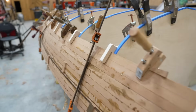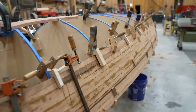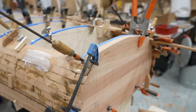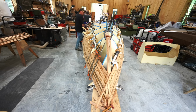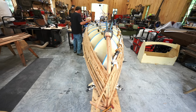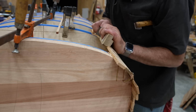and these little CNC clips just start to help me apply downward pressure. And those screw clamps, I do this technique, and again, I showed more of these details on Instagram, but I screw clamp the tip. The tip of the screw clamp is grabbing the planks that are already glued, and I make them really tight, and then I shift them sideways. And by shifting them sideways, it puts pressure on the plank that is being glued to the existing plank. And there'll be more examples of that.